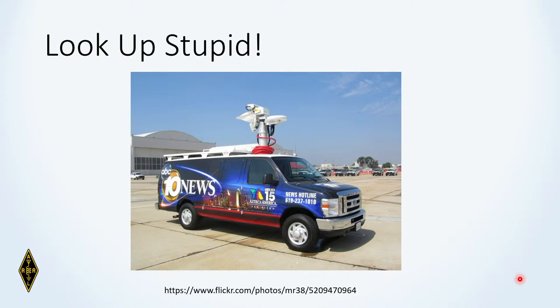But in the truck, and this, by the way, is a pneumatic mast. It's run by air. There's a compressor in the back of the truck. So you turn the compressor on, and this air fills the mast, and it telescopes upward, maybe 30 feet, 40 feet, with a microwave antenna on the top that you'd point back to a microwave receiver at the station.